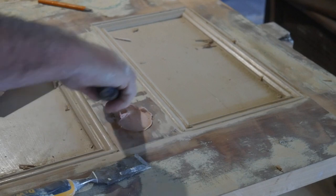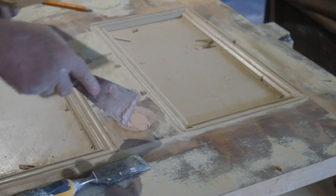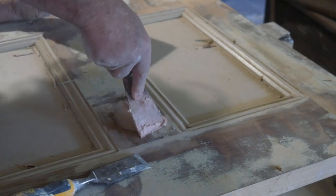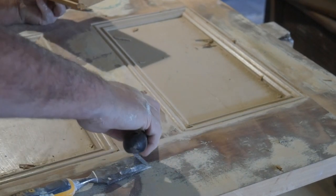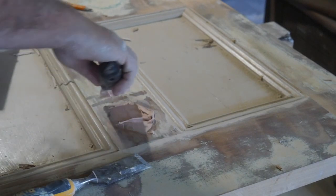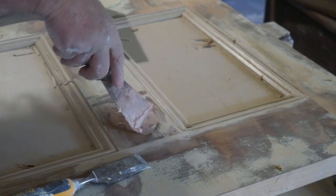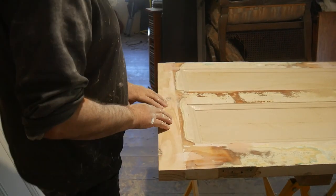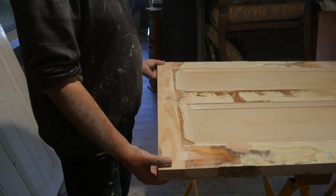We found another one over here — just sounded hollow. Give it a bit of a tap of the chisel and it went through. The whole inside of the door's probably got borer channels in it, because they can't just pop up in the middle of nowhere. They probably come in from the bottom, have their little channels up inside and then get near the surface in places, which is what's happened here. As long as the door's all solid there's nothing wrong with that. We've also planed down, bogged and sanded that piece of framing timber we added to the top earlier.